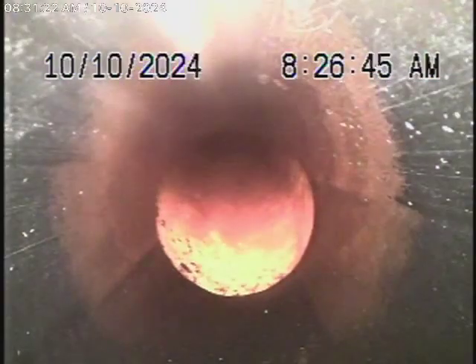It looks like there's a 6-inch cured-in-place pipe lining. This appears to be in good condition as of today — it's nice and clean with no roots getting into it, so this all looks very good. Just remember that if you ever have to clean the sewer line, you never want to run a cable with a blade through a lining because you can damage it.